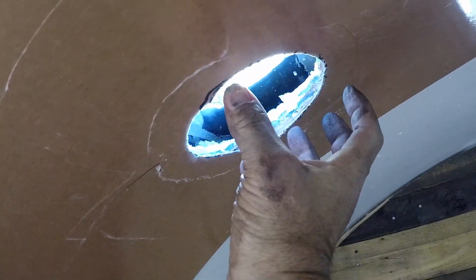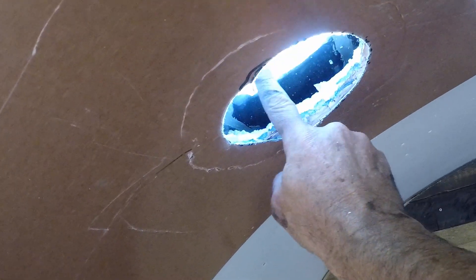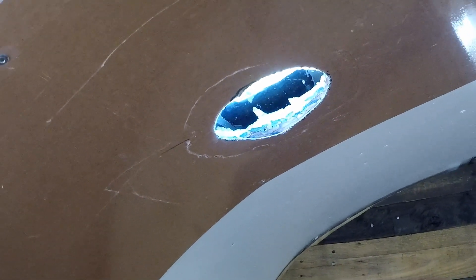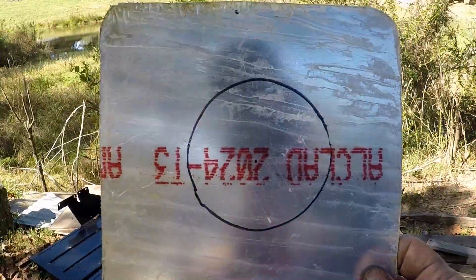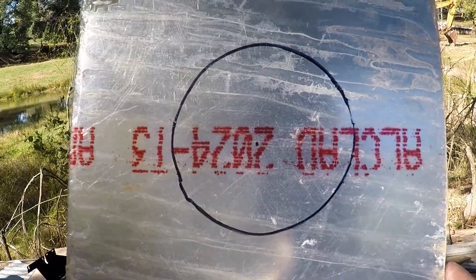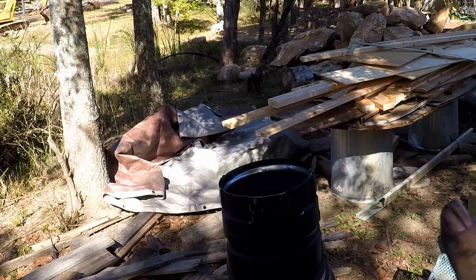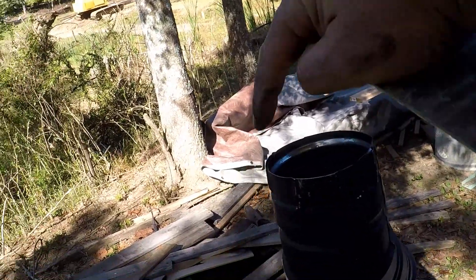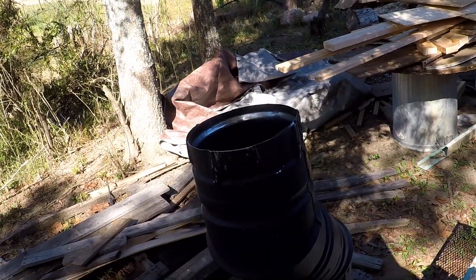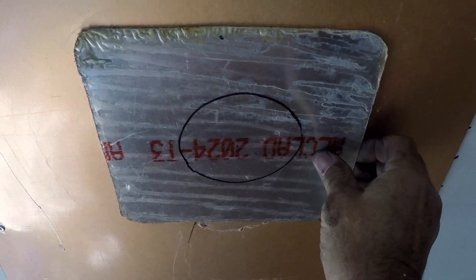I'm also going to put a small coupler in here — just a piece of flange that's going to go around the pipe in this area to protect from heat even more. I'm also going to be cutting what they call a heat shield for the ceiling, which is really to cover the hole. When this goes through the ceiling it's got a nice cap — I'll show you how that's going to go. I'm going to paint it black so it looks pretty cool.